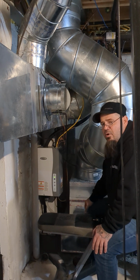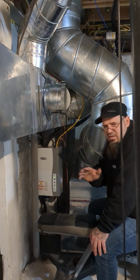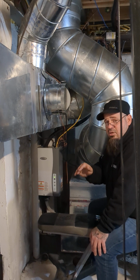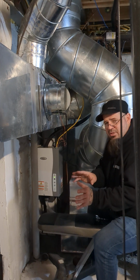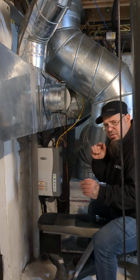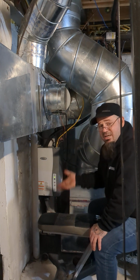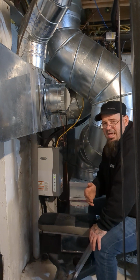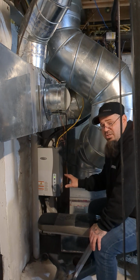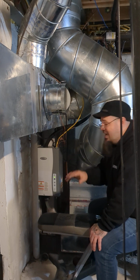And I do want to add one piece for everyone when it comes to humidity. When you humidify the air between like 40 and 50, some people will say 40 and 60, I keep mine at about 52%. What you're doing is the exact same thing that you're doing in the summertime in reverse. You're adding water droplets to the air. And like we said in our dehumidifier video, those droplets transfer the heat to your skin. So a setting of 70 with 52% humidity in your house, because this guy's helping out to keep your humidity up, is going to feel more comfortable than if it was 70 degrees with 30% humidity, which is often the case in the winter without adding humidification. So adding a humidifier actually will make your temperature, you can often get a couple degrees down on the thermostat out of adding this guy.